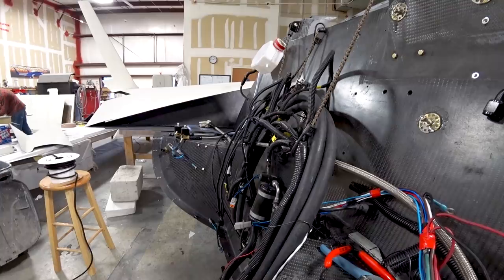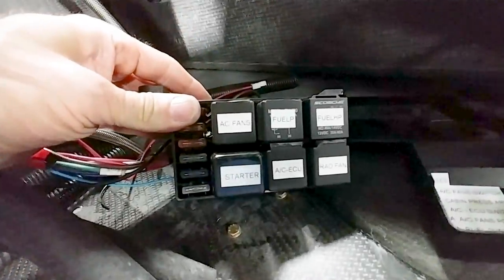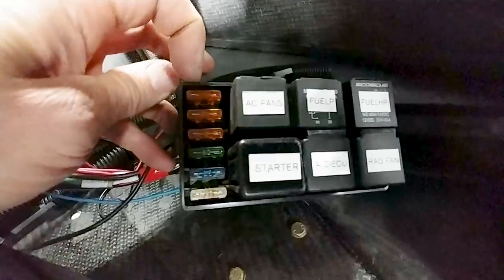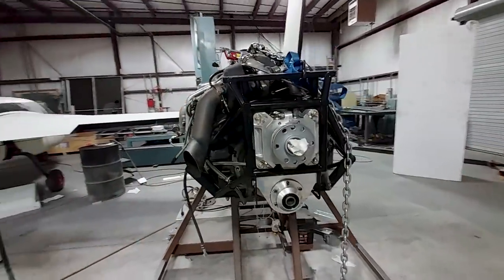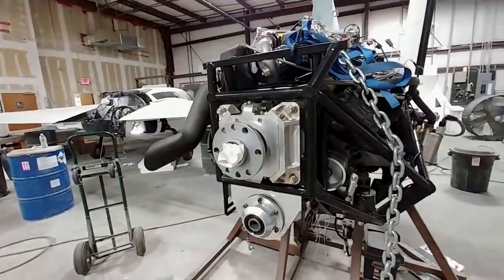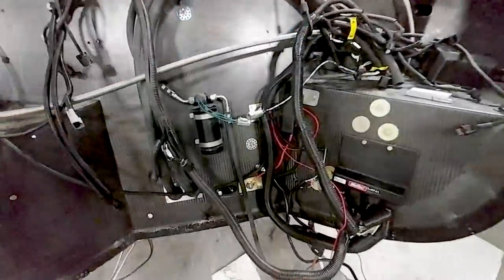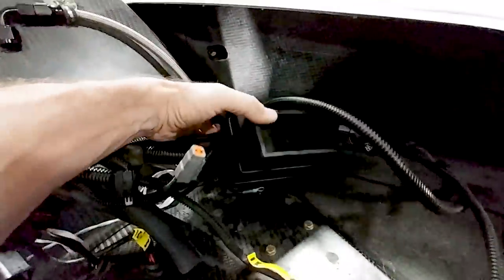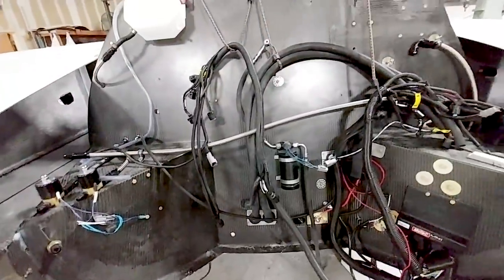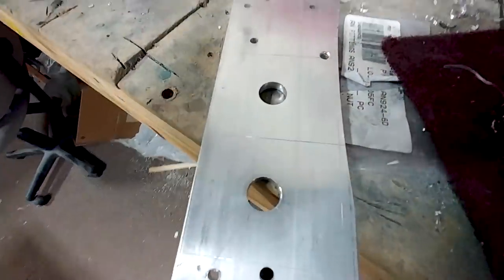With all the AC lines done, I just need to tidy up the wiring harness. I labeled the six different relays and put labels for the fuses inside the cover so I remember what they all are, what they do, and what size fuses are needed. The engine is shown with the redrive put back in after disassembly. Regarding the firewall, I've ordered some fiberfrax that people recommended and Jeff has used before, which I'll install on the rear bulkhead. I've tidied everything up with the wire loom back on — left it loose just in case I need to add another wire.